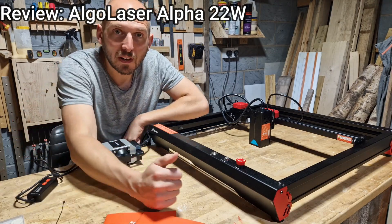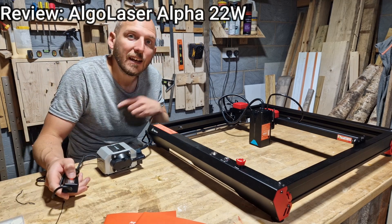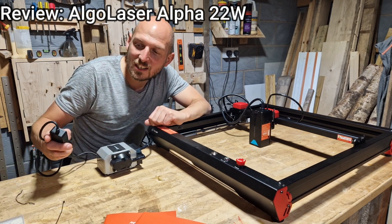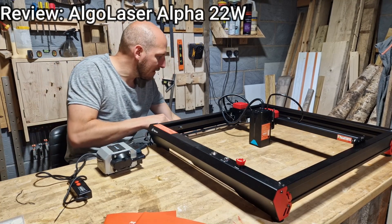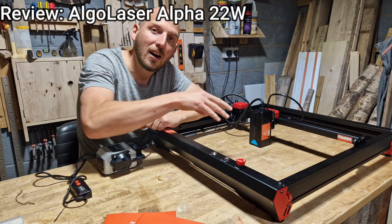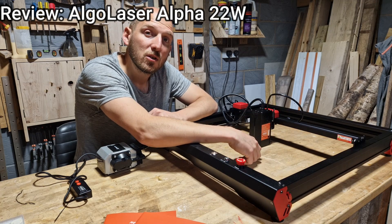Another feature is the air pump. I didn't really know what this was for, but it is literally as it sounds — it's for pumping air. This thing connects to this thing here, and you can turn it on. On its lowest setting for big engraving projects or cutting, you can turn it all the way up to max, which is actually still quite quiet. The air compressor pumps all the way around this tube, which is really long, through here, up through the arm, and there is a little nozzle on the inside of the laser housing. As you are cutting or engraving, it pushes all the dust, debris, and soot away to get rid of those scorch marks you often get.